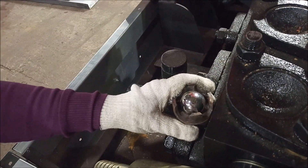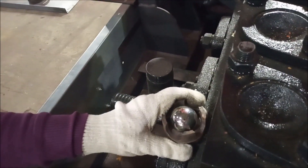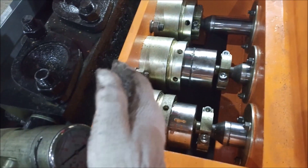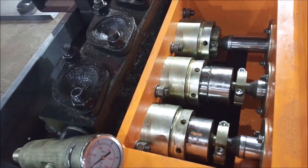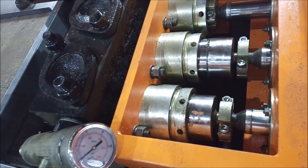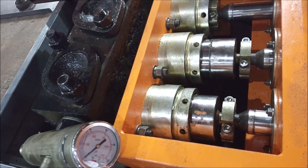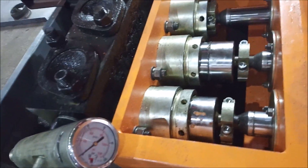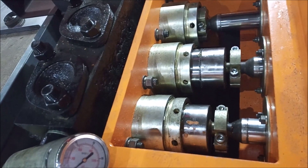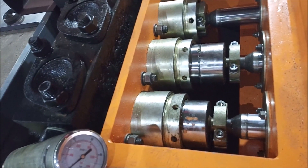This sticking only happens when the mud pump does not operate for a long period of time. Here is the piston and the seals. When the water pit is not filled with water deeply enough, you will see a lot of ash and sand. The ash and sand may get to the piston and to the seals, which will damage these parts.